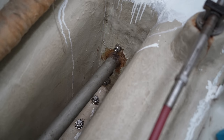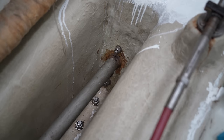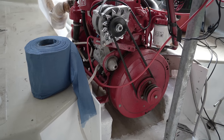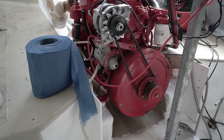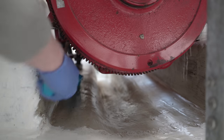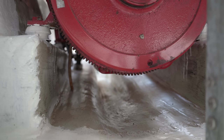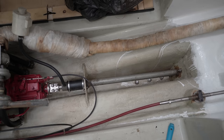The gel coat finish down below in Alan was dingy, grimy, and so I decided it needed some attention. My process was fairly simple — and as I've said a number of times, Alan's not a pleasure boat, so function trumps form especially in the working innards. First I degrease with brushes and rags to get rid of serious oil spills, fuel residue and grime. I then wipe it down with blue rag to see if I've got it clean or need another go. Once free of the worst I give it a good clean with sugar soap and then dry it with a microfiber cloth. Unless the surface is really waxy or shiny and so needs sanding to provide a key, I then crack on with the paint.